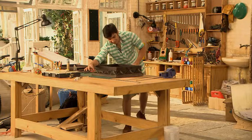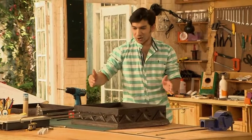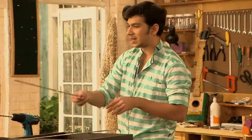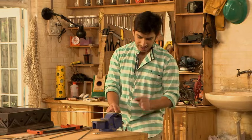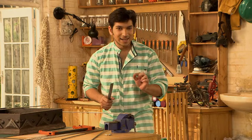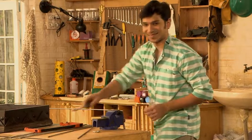Now, the exact length can be cut. I have to cut the hooked end and the pointed edge, and I will cut all the rods to equal length. This looks like the right length to work with, so I will cut the rest of the rods approximately this size. Now, after cutting the hooks, there will be a little bit of rod left that I need to file down. Now the rods are cut and filed.